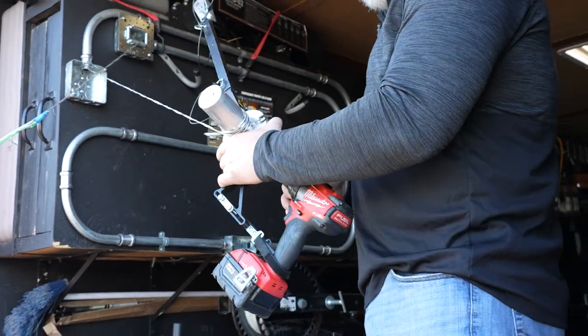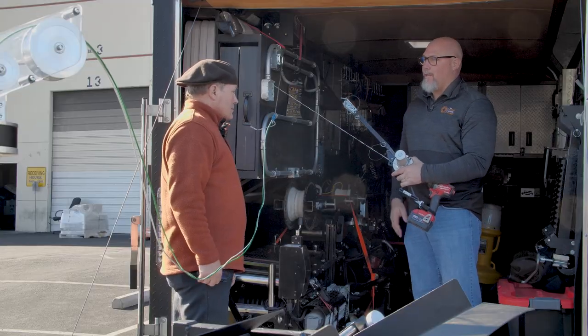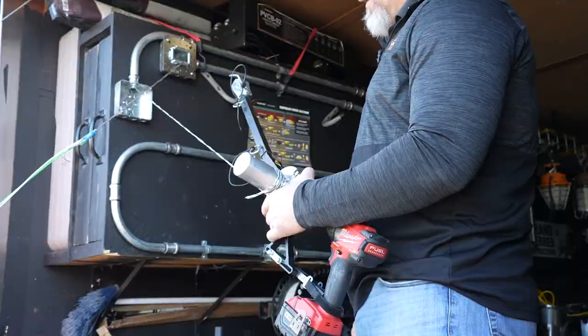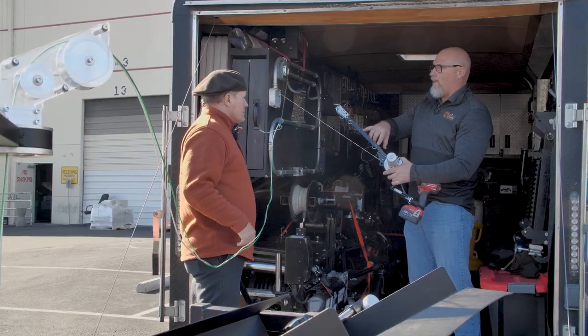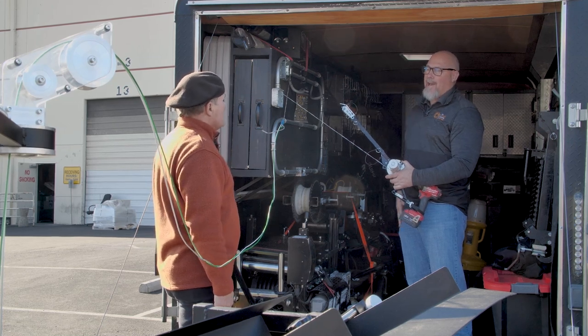What's nice about this is we can make this a one-man pull job. We can also plug in any drill gun on the job site, and a cool feature as well is we can pull these two pins and use three-quarter inch conduit, so if we have a high box, it keeps your guys off the ladder.